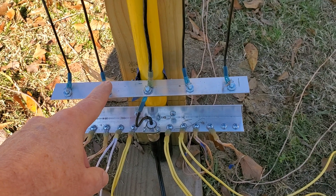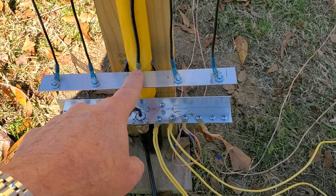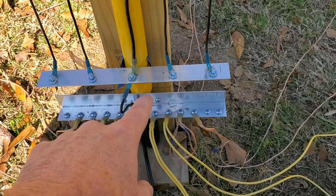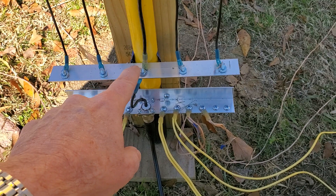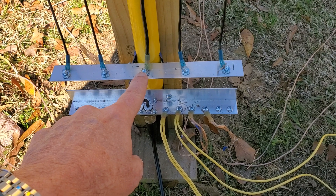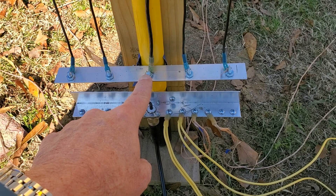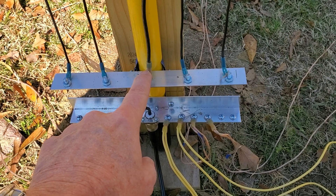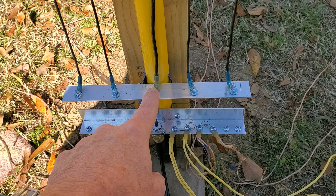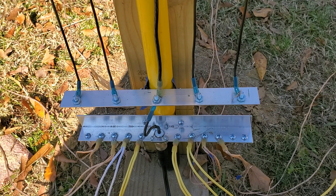What we have here is 20 meters, 17 meters — and 40 and 15 work off the middle — then we have 12 meters and 10 meters, so five bands. The center one does 40 meters as a quarter wave and 15 meters as a three-quarter wave. We'll talk a little bit about the performance on the 40 and 15 meter wire, and the compromise that has to be made if you want to do both bands on the same conductor.